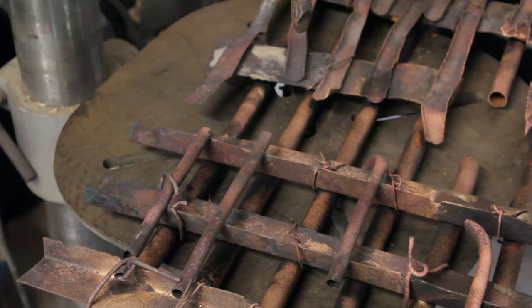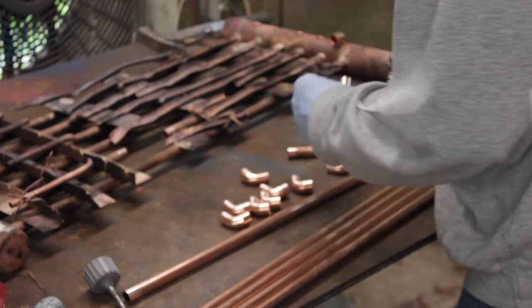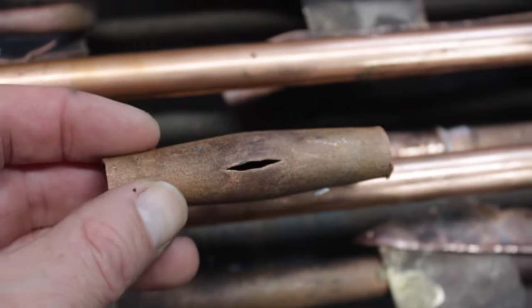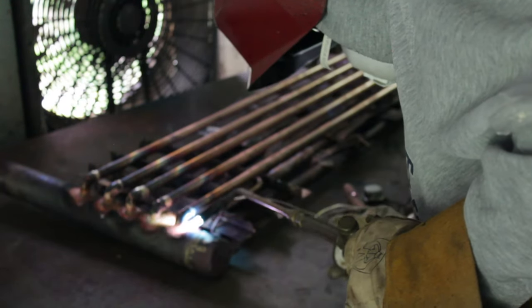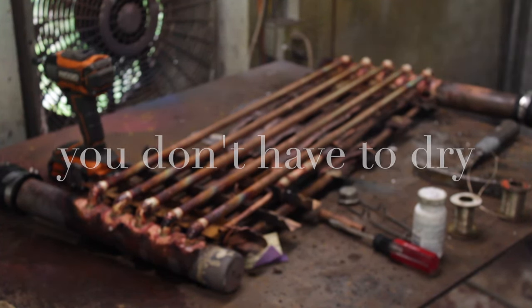I need to cut my pipe to get ready to be soldered. That's the fitting in here — that's the repair, which was the reason why I had to do this in the beginning. If it were full, I'd actually probably be running water through this baby. I've got about 60 PSI in this line. I sprayed it with a little soapy water — any leaks will make bubbles. It's pretty easy to see, and it's looking pretty good.